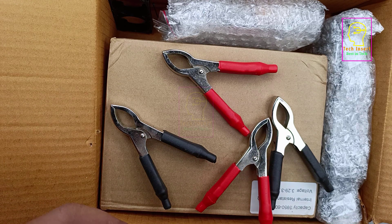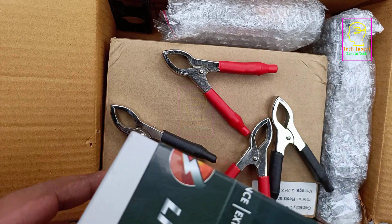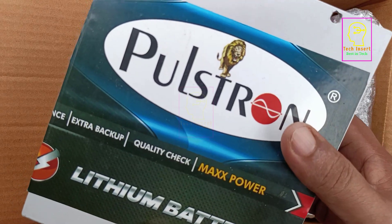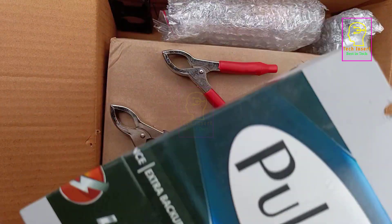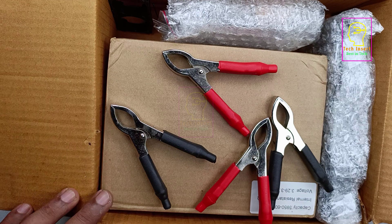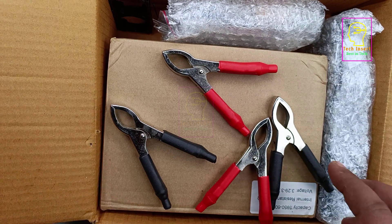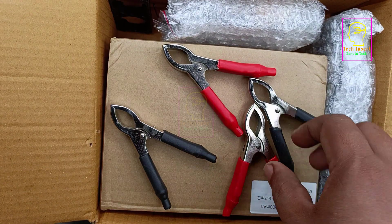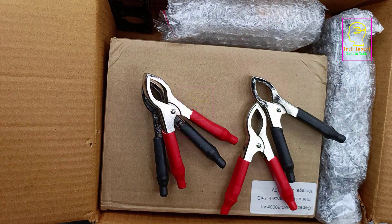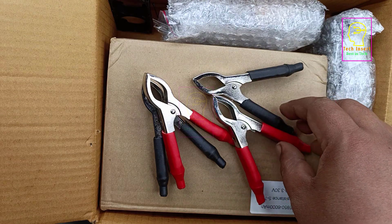The battery pack was slightly bigger, so I was unable to insert it into the existing battery box. Now what I'm going to do is make a 12 volt 24 ampere battery pack and insert it into the existing battery box. One advantage is we can carry this battery very easily. This inventory is for making a 24Ah 12 volt lithium ferro phosphate battery pack.